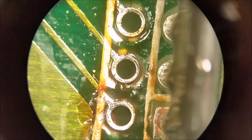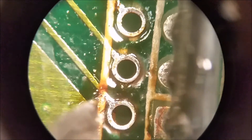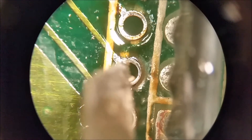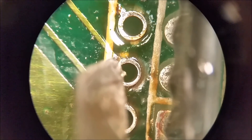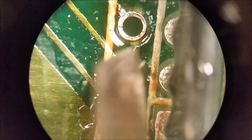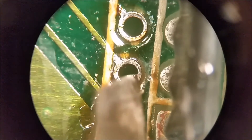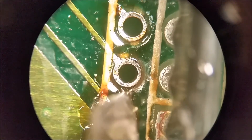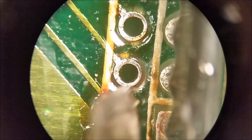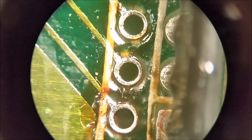I actually overheated the board a little bit right here — you can see that little white measle. But it won't affect the circuit function at all. That's because I was on here too long trying to fix this up, but it'll be just fine. Those are only little tiny ones. If I'd done the whole board and it delaminated, then I'd have to dig all this out and put in special board material and set in an island and run the trace — but since they're so small I'm not going to bother with that.